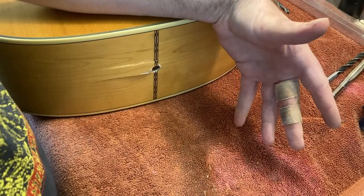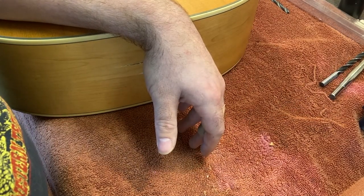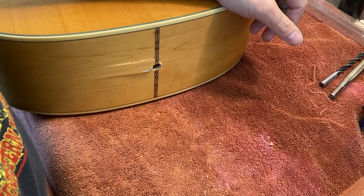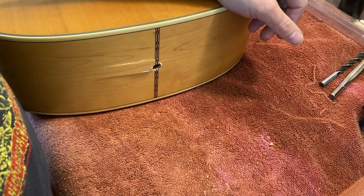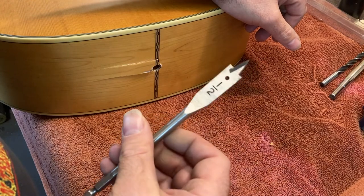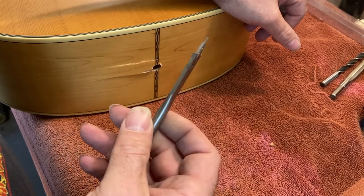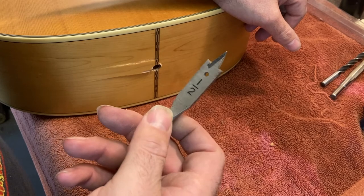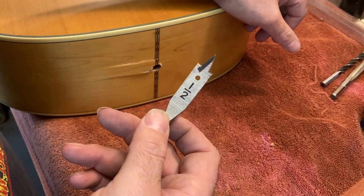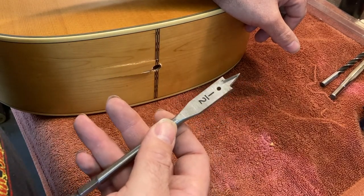This second method involves a drill bit that I'm a little less happy recommending. But if you've got a cheap guitar — not a Masterbuilt, just like a Johnson or a $99 acoustic that you just want to throw a pickup in — this is probably fine. It's going to cut kind of a rough hole, I'll warn you right now. This is called a spade bit. This is generally something you see people buy for one-off jobs at Home Depot — drilling doorknob holes or whatever. I barely touch these here. I have them in my toolbox because I used to do much rougher work with bigger lumber, like chicken coops, where it didn't really matter if the hole was all that accurate.